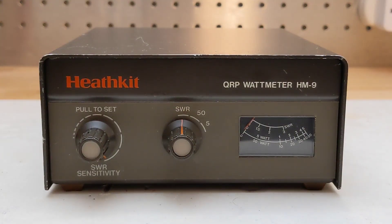The HM9 is a power meter and SWR bridge. It's wired at construction time for one of three frequency ranges: 1.8 to 30 MHz for the HF bands, 50 to 54 MHz for the 6 meter band, or 144 to 148 MHz for the 2 meter band. It measures SWR up to 3:1 and power in two ranges — 0 to 5 watts and 0 to 50 watts. Making an SWR measurement requires a minimum of about 1.5 watts. It handles a maximum of 50 watts input, needs 50 ohm transmission lines, and the power meter accuracy is plus or minus 10% of full scale.